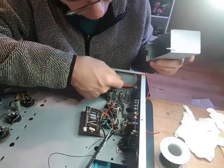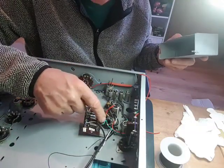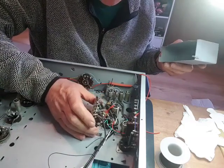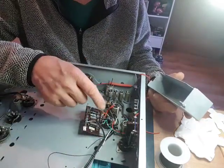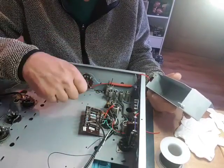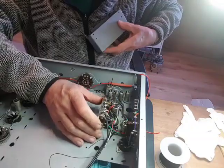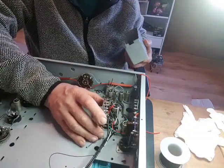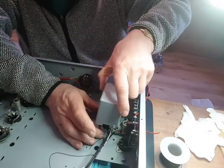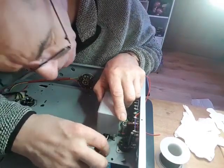I'm just using heat shrink on here but I'm waiting to get proper tubing — I just wanted to see what it looked like. These aren't actually wired into anything yet. I've done the wiring as tight as I can. I discovered some of these valve pins, although I thought they were clean, weren't very clean when I tried to solder them, so I had to scrape them all up to get the solder to adhere. Very tricky. Once I get that bolted down properly, these three capacitors at the back go over inside.